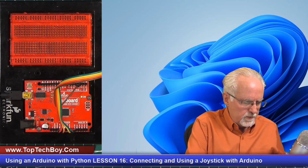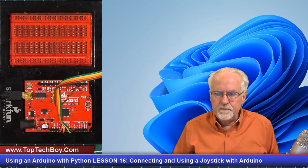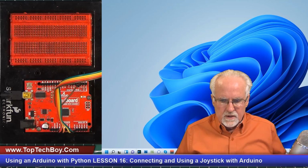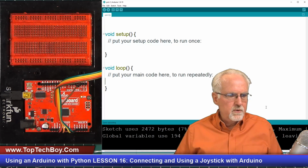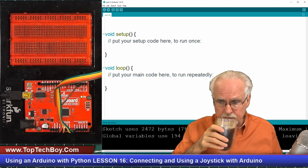And again, just a quick look at how we wired the thing up, and you need to do something similar. If yours are in a different order, just do it where your X goes to A0, your Y goes to A1, and your master switch goes to digital 2. Then we should be okay at that point. All right, we are going to move the sketch pad out of the way. I'm going to get my keypad back, and now I need you to fire up the Arduino IDE. I will open up the Arduino IDE, and we've got a fresh new program just ready to be written.